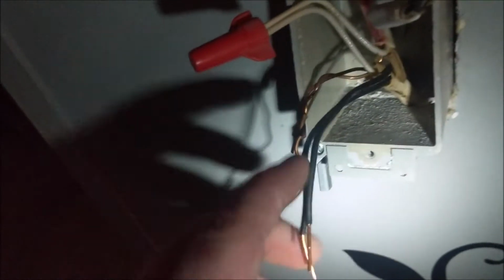But my friend who is a union electrician told me to do it the other way that I just explained to you guys. So now with this hot here, I'll put this down on the bottom screw. This is going to be my switch hot. So this is going to go back up to, and this switch is old and ratty, but I don't really give a fuck. So I'm going to go ahead and just get her done. And as soon as I am done, I'll show you guys exactly what I'm talking about, because some of you are probably scratching your heads wondering what this is about.